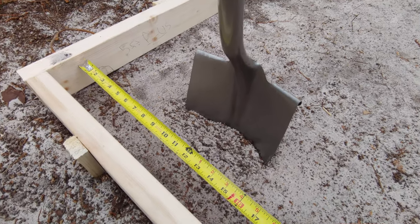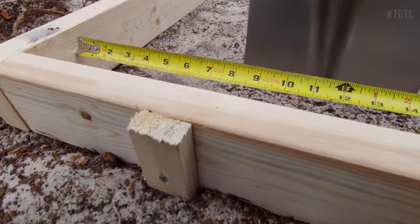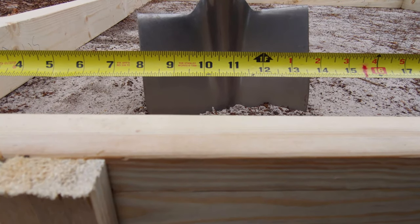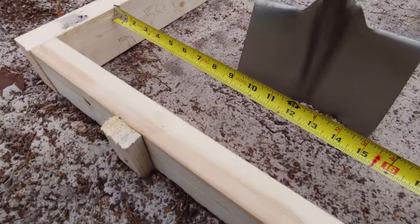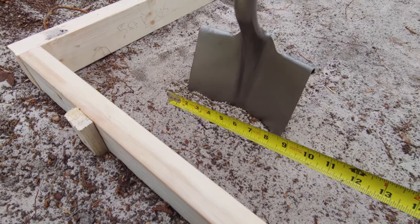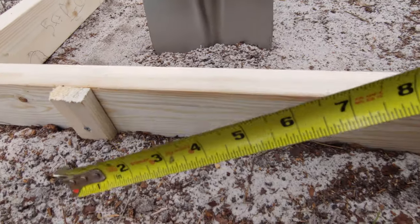All right. So, as you can see here, the conduit closest to the concrete pad is 8 5/16 inch. Maybe you notice a potential problem here. Well, the issue is 8 5/16 inch kind of rides close up on this stake. And so the conduit's going to come down and over, and it's going to be a problem. So what we're going to do is we're just going to move the conduits over from about here, a good inch over, and then they should be able to run right through here and not hit this.